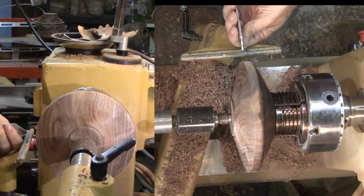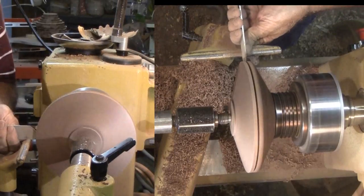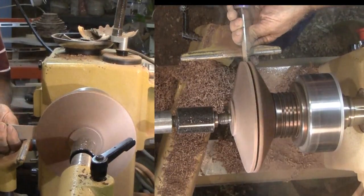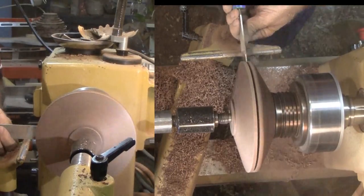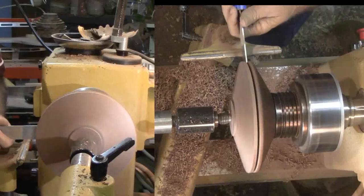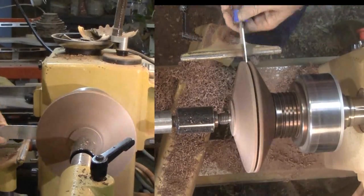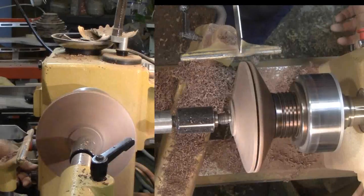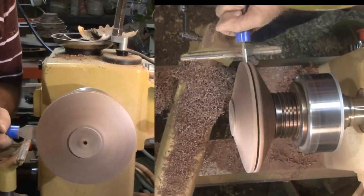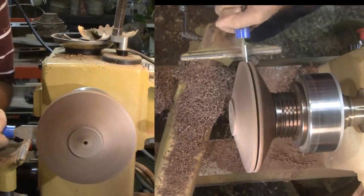Now for the first step to hollow the interior. Instead of poking a tool into the center hole, I'll address the outer edge of the exterior with a parting tool. At first, I can widen the kerf just a little by wiggling the tool back and forth. Later, I'm angling the parting tool a little each way to make sure the kerf is wide enough to not bind on the tool. As I get close to the center, I remove the tail stock to avoid the wood binding on it when it comes loose.